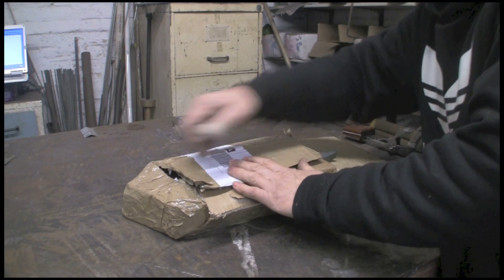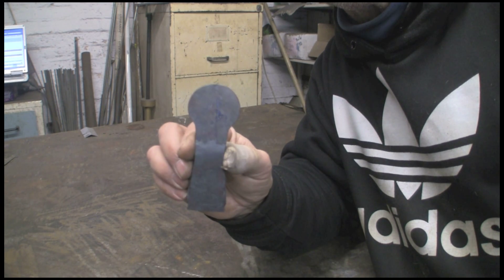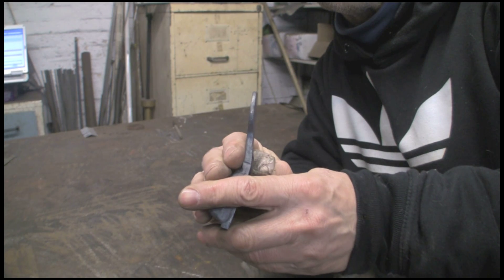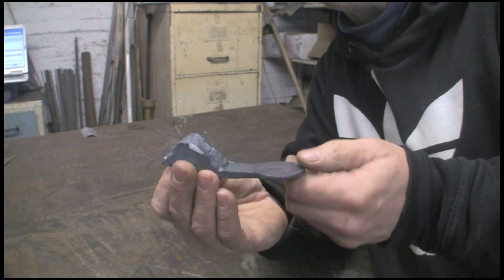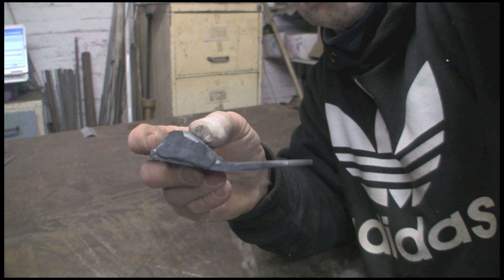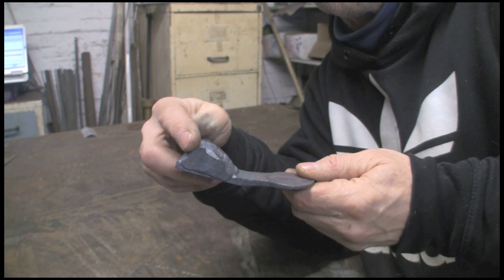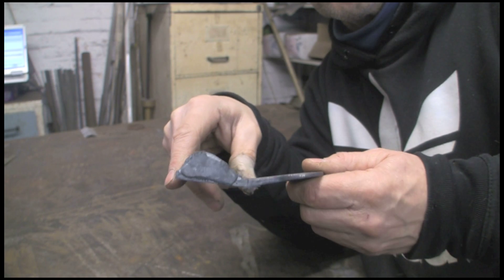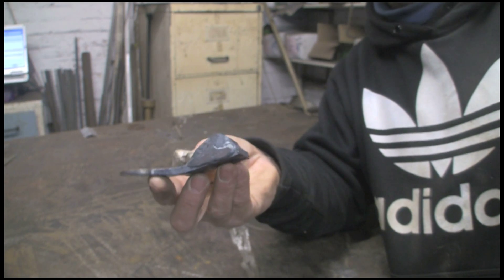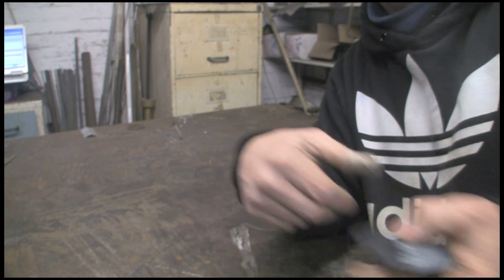This is the first bit. I've already put this through the forge because the original is much thinner at the end — I've forged that down to just over an eighth thickness at the end, more like the original. I made it smaller on the laser cutting so that it would come out bigger once I'd forged it. As you can see I've already welded on these bits, because it's like a counterweight — it has to drop forward to lock. I put a bit of 16mm up the end and then a bit of 3.8mm behind it, then just welded the whole lot up into a big blob. So I've now got to weld the lugs on the back edge, and then I'll grind it up and we'll see what it looks like.